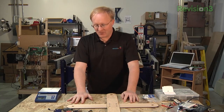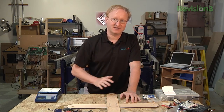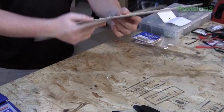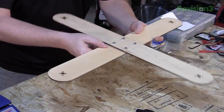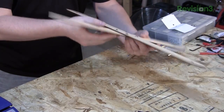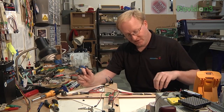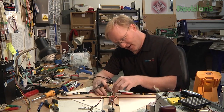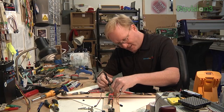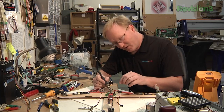What I'm going to do next is mount the four motors into this frame so we can check if it works with all four axes and try the tilting — we'll put pieces of tape instead of propellers to make it safe, but we should be able to see if it does what it's supposed to do. I have bullet connectors between all of the motors and the motor drivers, and I'm now attaching all the motor drivers to the central power hub so we can attach the battery directly and everything will be powered. Then we can do a four motor test.